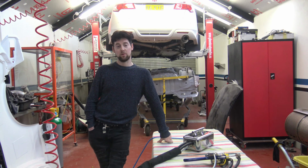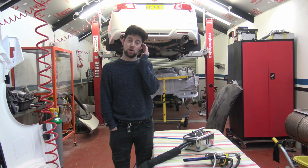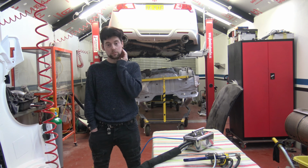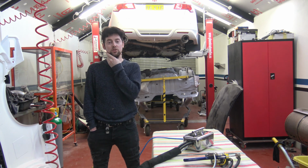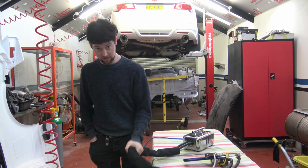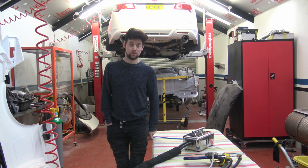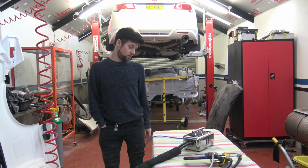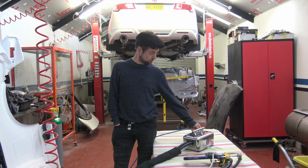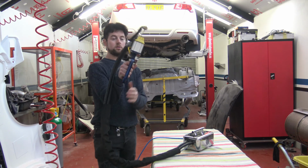The way the transformer core is designed has a major impact on how the manufacturing and the final product welder has turned out. It is crucial to have a strong transformer core design. The high current cables, these high current cables are 95mm square. They're quite heavy, but you need them to keep the voltage down, keep the resistance level down.